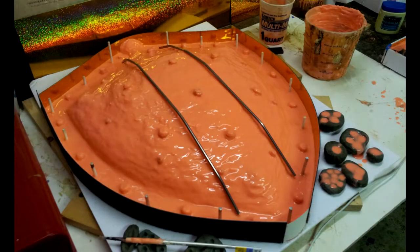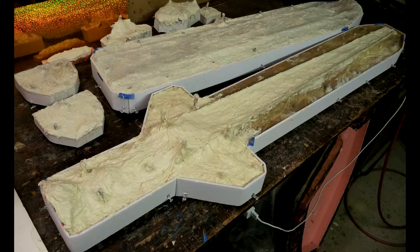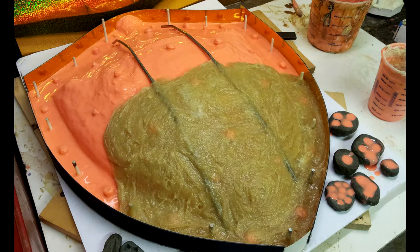Same thing for the shield — I put bent steel rods in there. Then I applied the plastic paste for the mother mold shell. It's like an applesauce consistency — mix one-to-three ratio part A and B, smear it on everything, and it hardens in about ten minutes, so you have to be quick with multiple passes. Once done, it's also very sharp with fibrous needle-like points everywhere. I then power-sand it all smooth.